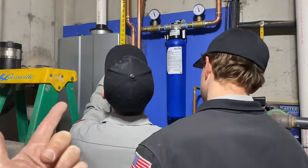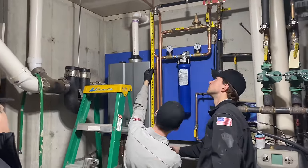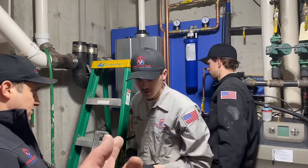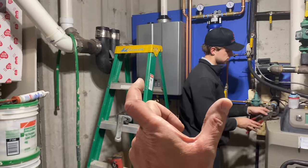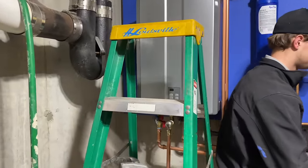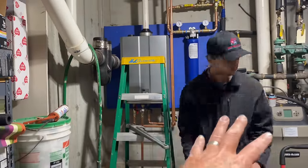The plywood, you saw, we shot two pieces of 2x4 into the foundation wall, mounted the Rinnai RSC-199IN. This is the condensing tankless water heater with built-in recirculation. If the homeowner would like us to set that up, we can add that little T-manifold that you see with the flow check on the furthest fixture and set this up for recirculating. It's built in. We could do that. It's just an added upcharge for the service call, the install. We could also do it later as well.